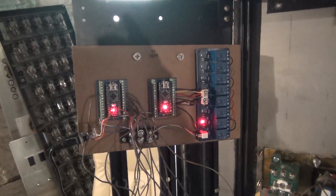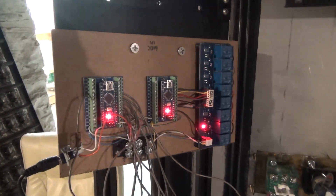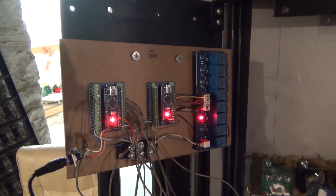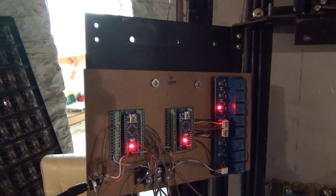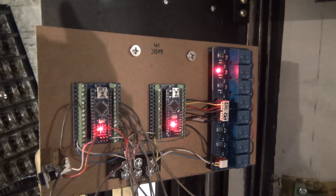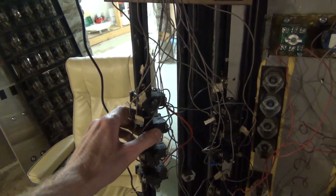Now I have the rest of the buttons hooked up and I can start testing the functionality of the panel. I can use the lights on the relay board as a simulation for the PI, so I don't actually have to hook up all of those just yet. If I place a call into the panel, you'll notice that the LEDs start changing on the relay board — it is currently moving down. I can also add another floor in, you see there on number 2, and this thing will make a stop on floor 2. This was my first time running this software on this panel, so I'm pretty pleased with how this works to begin with, though later I find more bugs I have to work out.